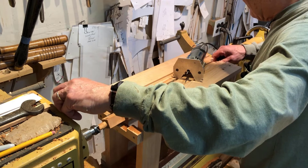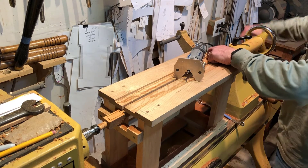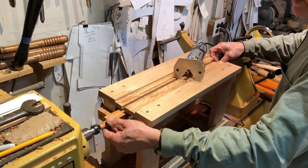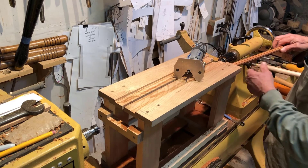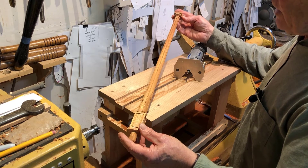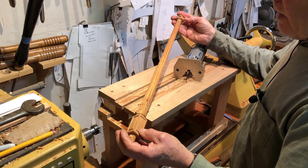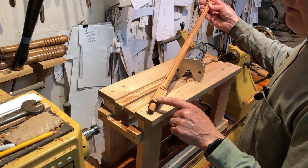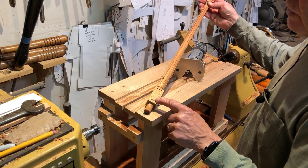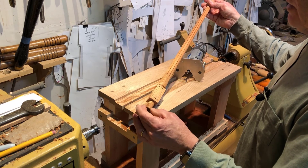Just checking to make sure I've done all the grooves. Holly — one-sixteenth-inch holly — is the inlay that goes into these grooves. Here you can see it ready to install: the holly, then a banding. I had another fixture that created the one-eighth-inch groove for the banding that goes into the face of the column.